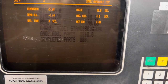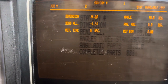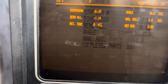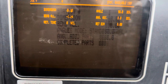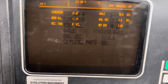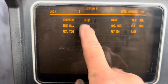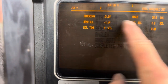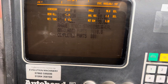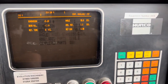The only other thing I haven't shown you is the retraction. Go to Station — there's a retract time and a retract dimension. Retract time is a delay: put 2 seconds in there and the back gauge won't come in for 2 seconds, or 3 or 4 seconds — it will wait. The retract dimension is how far back it will retract from that position. Put 10mm in and it will retract 10mm, so it goes out to 35mm. Quite a useful feature.